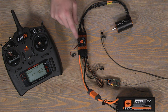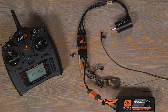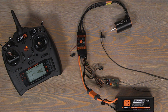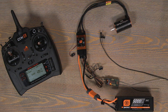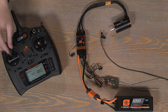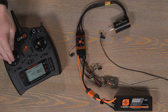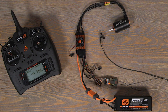Let's change the motor rotation - one of my favorite features. If you plug in your motor and it's spinning the wrong direction, instead of having to swap wires and take your cowl off, you can change the motor rotation using stick programming. We're waiting for parameter number 10, which is two long tones. There she is - two long tones. We put the stick all the way down, wait for two short beeps, then stick all the way up. Now the motor rotation will be in the opposite direction.